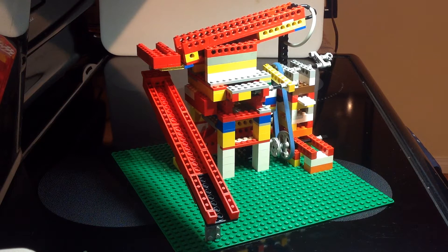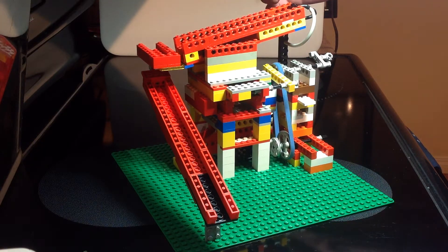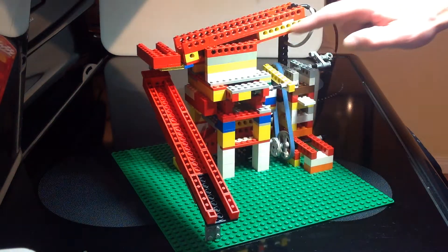So this unit is my latest idea where along the top here we would have probably a half inch punch plate — shovel dirt here — and then just gravity fed and washed down with water and probably overhead spray bars to get the material to move down this trough. As it moves down it's going to go through the punch plate, and below here we would have quarter inch punch plate.